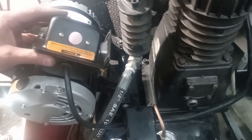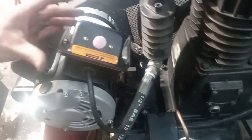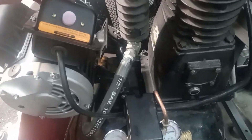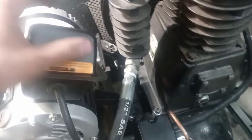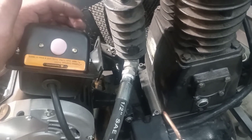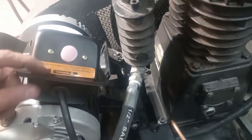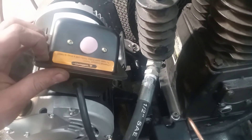One last quick note: you may notice the wiring box is now facing a different direction. The bolt pattern that holds it on is square with a rubber grommet underneath, so you can undo the four bolts and clock the box whichever direction is most useful for your setup. It doesn't matter where the ground bolt ends up — you can still use the ground bolt with the ground marking in the case.